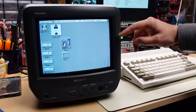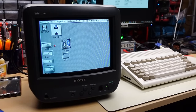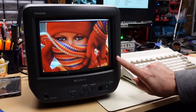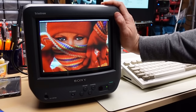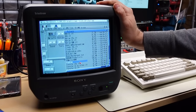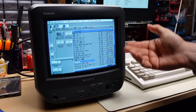Sorry about the bar moving up the image — that's the camera scan rate not mixing exactly with the Amiga. There we have it: Amiga Workbench with pretty good clarity on this little Sony TV. Let me load a picture so we can see how nice it looks. All 4096 colors in HAM mode on this little set, and it absolutely looks phenomenal. You have to take my word for it because putting a camera towards a CRT never results in a very good image — up close it'll just have a moiré pattern.